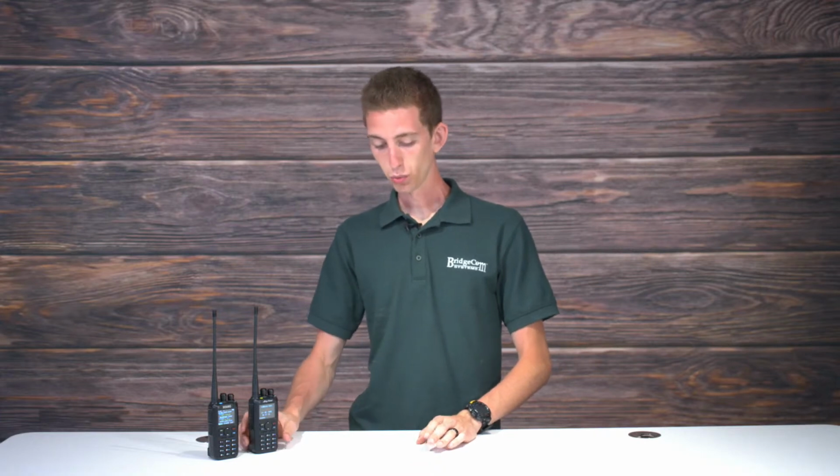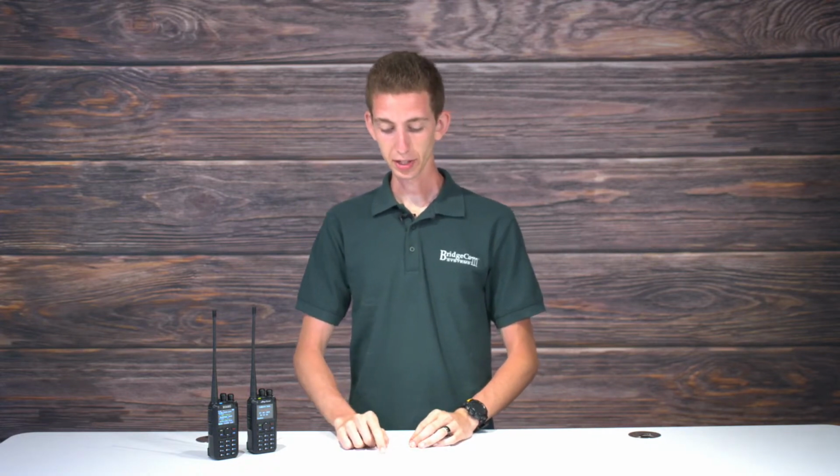So first up, we are going to enter our information in one of the radios, and then we'll do it in the other. And if we have time, maybe we will show you another frequency as well, just so we can switch back and forth. The first step is picking your frequency. If you look at the amateur frequency ranges, you can look that information up on the internet. Today I decided we're going to use 146.020 megahertz for our frequency, and then we're going to use a CTCSS tone, 159.8 hertz. Now you can obviously pick what those frequencies are going to be as long as they're within the amateur spectrum. Or, if you're a commercial user, that could be totally different.